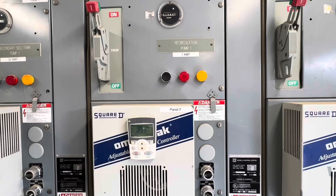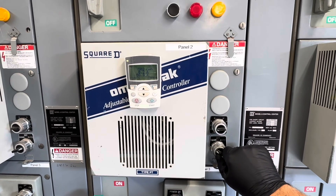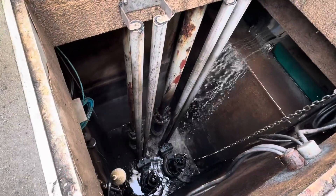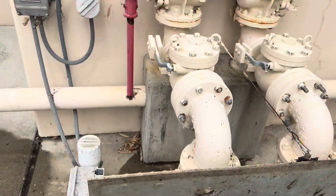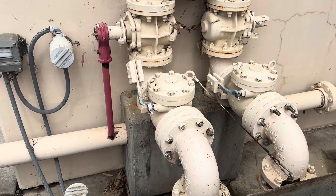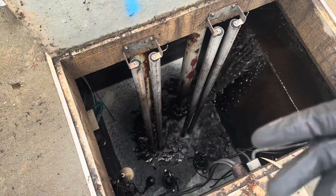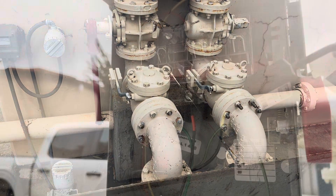We've reset the pumps - everything is clean and functioning, the pumps are in good shape. I need to fill that wet well with water, so I'm going to turn off one of our recirculation pumps that goes back to the trickling filter and fill it with some secondary water - otherwise it'll take a long time with a hose. We have enough water now to bump the pumps and see our check valves move. There they go - both pumps bumped. That's a great way to check for flow; those check valve arms move as you can see, confirming we have flow and have gotten our prime back.